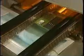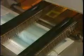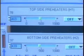Regardless of the method of fluxing, many systems employ an air knife immediately following the fluxer in order to remove excess solvent and flux from the bottom surface of the assembly. The air is directed at a slight angle back toward the fluxer with a carefully adjusted low flow that does not drive off all the liquid. The air knife helps spread the flux and pushes it up into the holes. If excess flux is not removed, there's the possibility of the flux dripping on the preheater and possibly causing a fire. Speaking of the preheater, let's take a look at why we need to preheat the assembly.